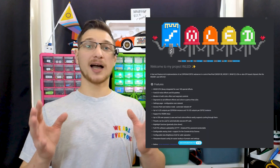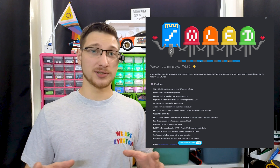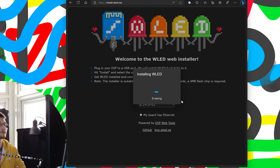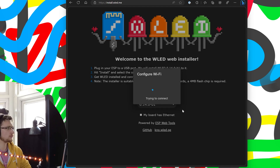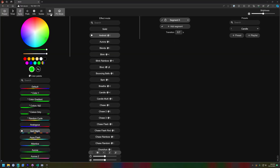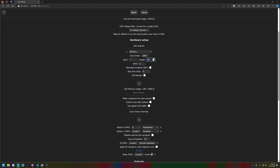With all the LEDs installed and connected to the microcontroller, we can install some firmware. I'm using WLED because it's full of features, I don't have to maintain it, and it's super easy to install. Just plug the D1 Mini into your computer, head over to WLED install, click the install button, select the port it's connected to, and it will start installing. It'll ask for your Wi-Fi — fill that in and you're basically done. Head over to the web interface to play around with all the settings. Quick note: don't forget to configure how many LEDs you have in the chain. Under Config > LED Preferences, there's a number — by default it's set to 30, but with this one I'm using 25, so just set it to however many you have.